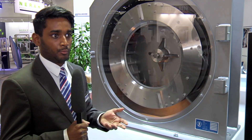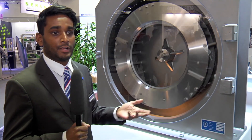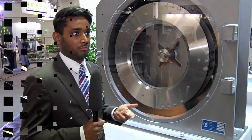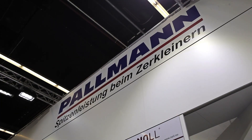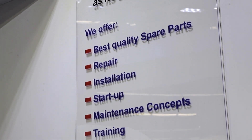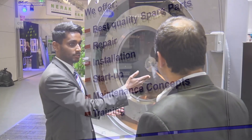This is a contrast when you compare it with other conventional mills like pin mills, hammer mills, or universal mills. This main characteristic results in high centrifugal forces which keep the screen clean — that's a huge advantage.